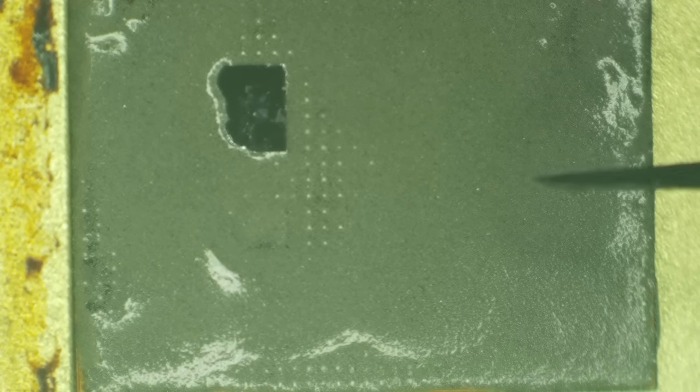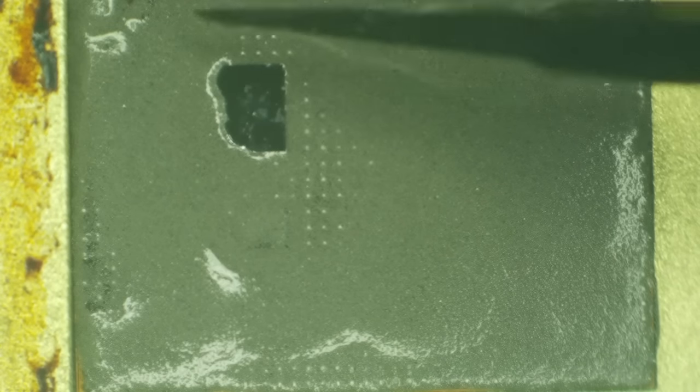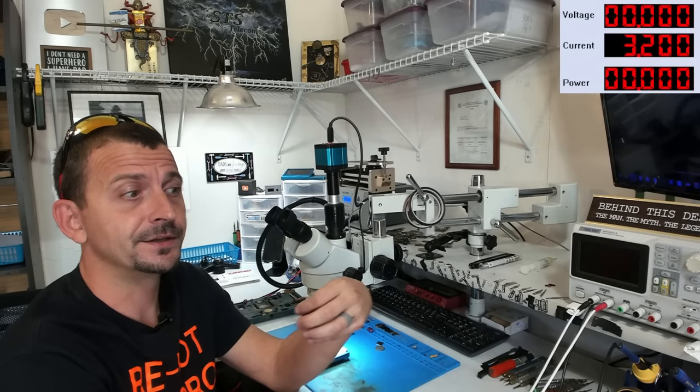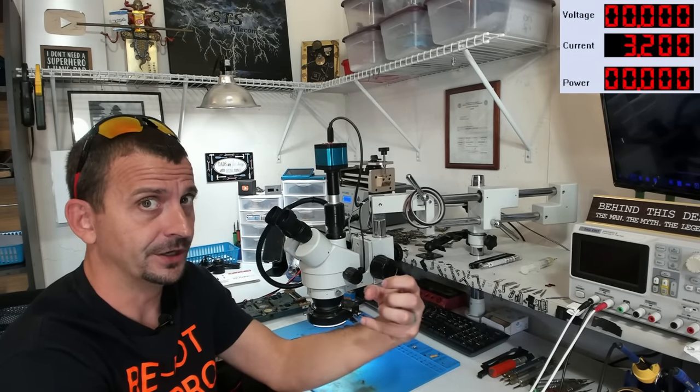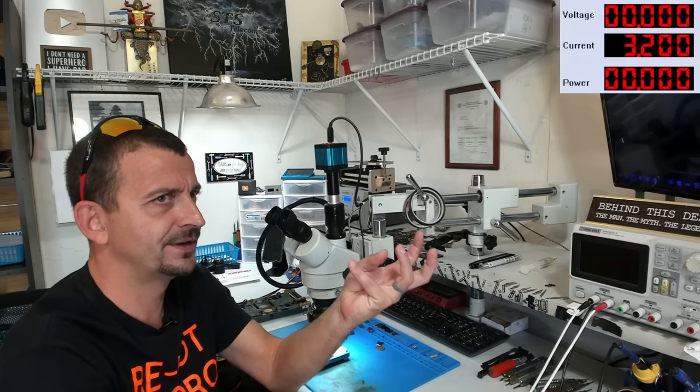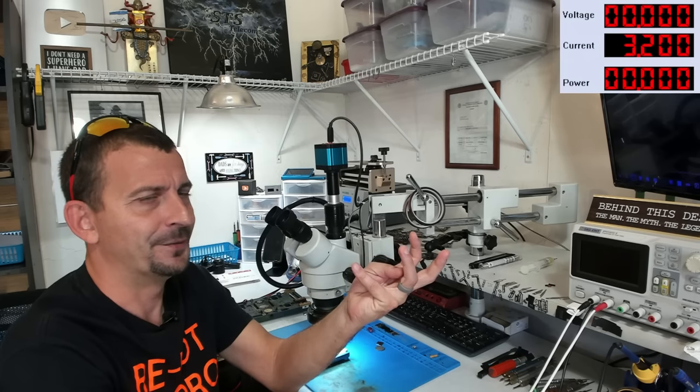All right, so any second here, the solder paste is going to begin to melt. And what that's going to do for me is start to dilute the alloy that's already on the CPU, because I need everything here to melt at a much, much lower temperature. If I rake across something that's not melted, it's going to tear a pad off of the chip. So having this hard metal alloy stuck all over this thing is a pretty bad thing.